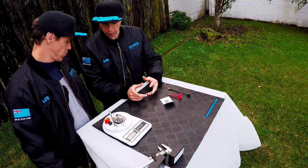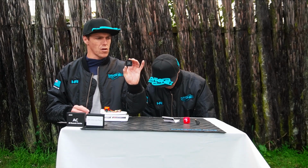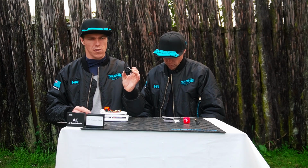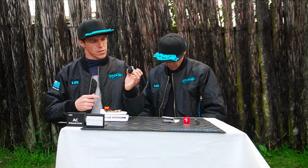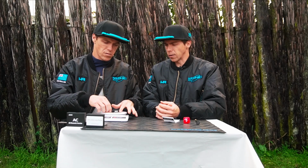And you've already seen the fan, for all those people using Betaflight. That's right, and you're talking about the cooling fan. That is quite an important feature, because when you punch it up to the 3 watts and hold it for ages, if you just have heat sinks, it would just cook. So you absolutely need air sucking into it. It's a more stable connection. Otherwise, it'll start dropping with power and flickering out. So there you go. We should be able to do all that and see what happens. You excited? I'm excited.